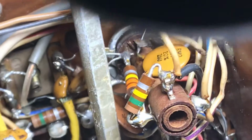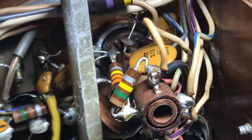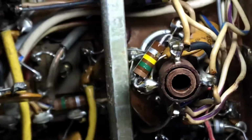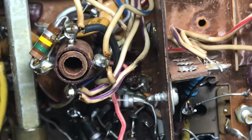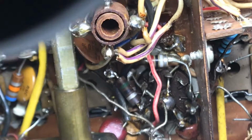So in many cases with these old Drakes, they're hand wired and you just don't know what's wrong. Cold solder joints, wires touching, wires that have been really close for years are touching because somebody was in here fixing something else. You just don't know. And I found sometimes you just want to go through here, check every connection to make sure it's not broken, or it's not half soldered, or it's not touching something else or very near, and you might get lucky. So there's really not much skill in these old radios as far as debugging them. It's mostly just good eyes and looking for trouble.